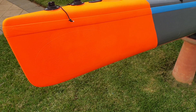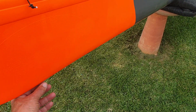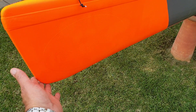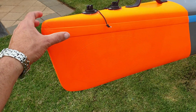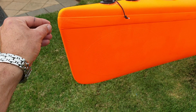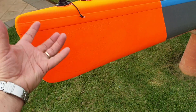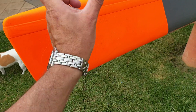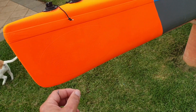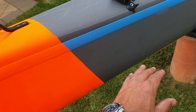It's come up pretty good. I'll put Keel Easy across the front here on top of the Plasti Dip and bond it on myself, just to give it a bit of protection at the front. If it does start to peel, it'll let go. Make sure it's one piece, as Rod said — from the front to the finish line, one complete nose cone piece. Don't try and do it in strips; it won't work, it'll peel at the join line. As you can see, the join line is away from the water direction.